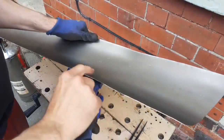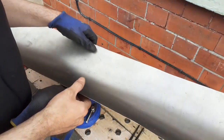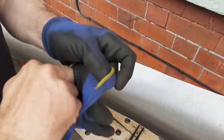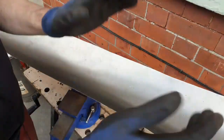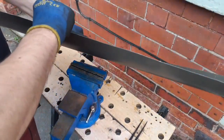Welcome back. I'm going to put in the 90 degree fold — not tight, just roughly, because I need to be able to move it one way or the other. Once I've put a really strong line in with the planishing hammer and the weight, bear in mind I don't have a set of folders. If I had folders I could just fold this immediately.